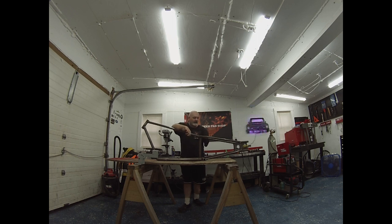All right guys, as you can see I don't have a whole lot done right now on episode three of Trackzilla. I have been working on it hard though — I got some of these welds cleaned up and went back over them again. I had problems with my welder — it was causing spits and spatters. Two reasons: the power company was working on the power grid changing out a generator in my area, and two, my cable lead for my welding wire was real dirty. I cleaned that out with brake cleaner and then sprayed some WD-40 down in it, and that took care of it.